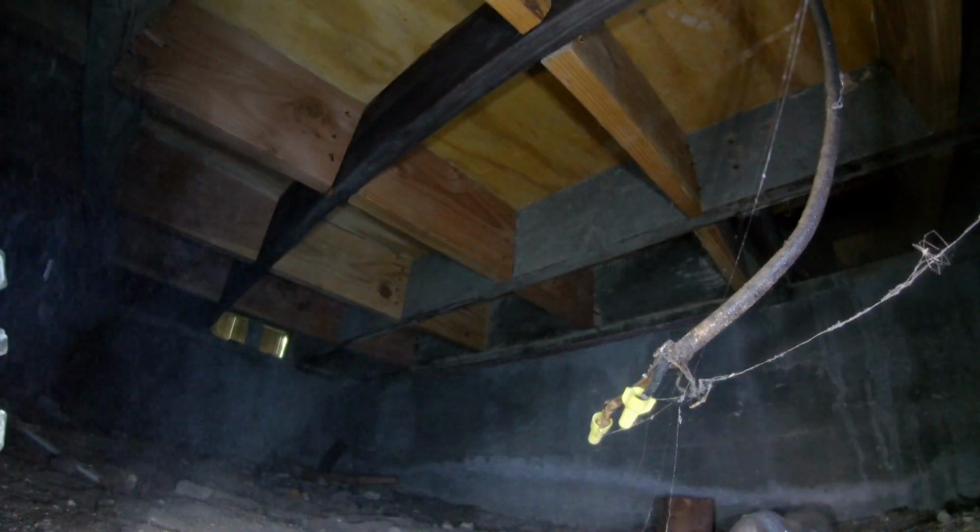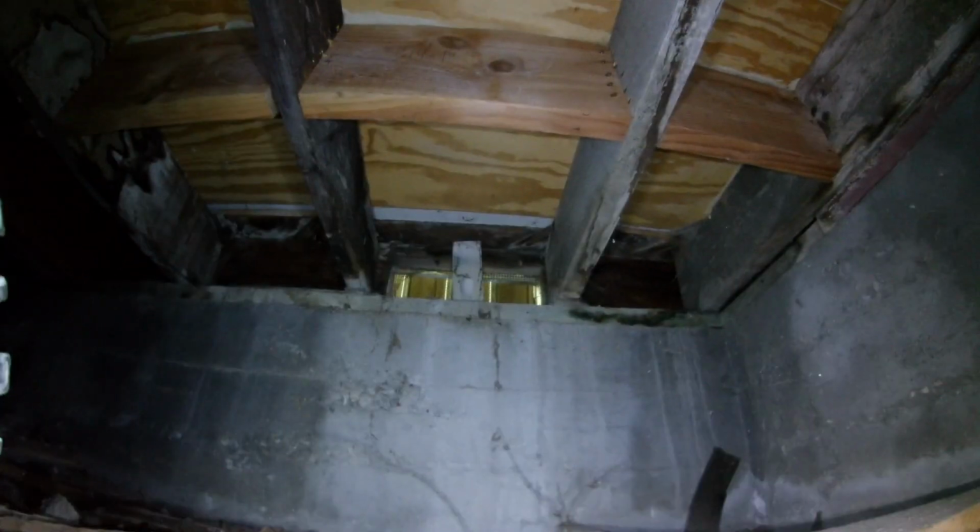Raised foundation, concrete, and this is just the robot showing you the picture inside. What I like to do is go to each corner, make sure I don't see any cracks to the foundation, and go around. This is a loose electrical conductor that's not in a junction box. I don't know if it's still active. I'm going to note it, because what happens is, you flip a light switch and that becomes active. So I recommend installing a junction box on that.